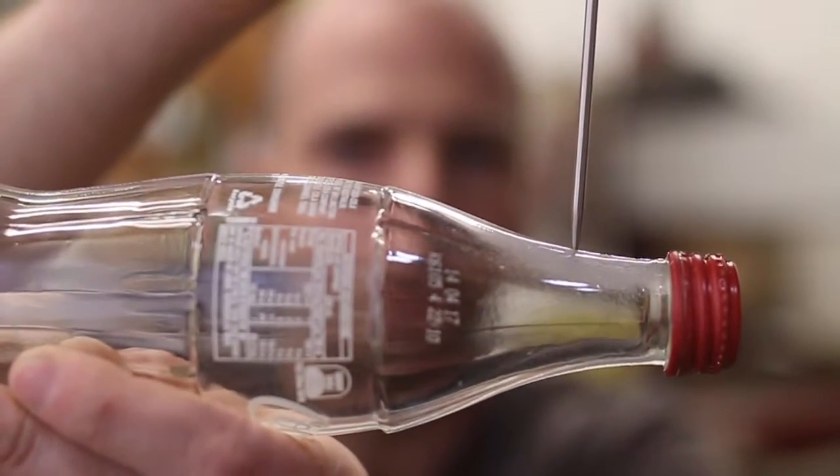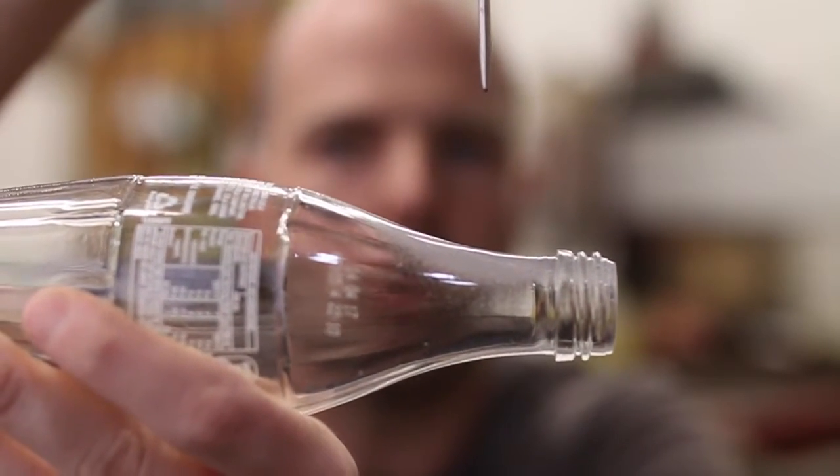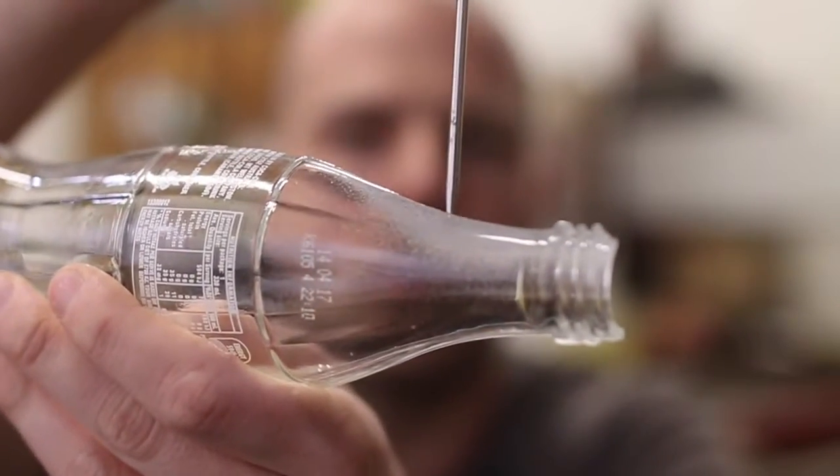And so when you're cutting with a nozzle, it's not a perfect cut. The water isn't bursting out vertically — it sprays, and the water is already spread out by the time it hits there when the nozzle's up here. I'm not sure if you realise this, but it's very fine sand called garnet that does the cutting. So it's spreading out, hitting the glass like a machine gun — and that's what's giving it that frosting effect. But it still cuts okay, just a bit messier.